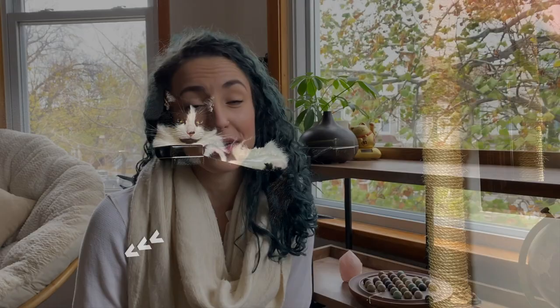When it comes to paint there are multiple different sheens. The rule of thumb I like is: how much stuff is going to be getting on the walls in this room and will I need to be washing it off? The spectrum goes from flat all the way up to high gloss. Flat paint is what we use on ceilings — it's nearly impossible to wash; just touching it can make a mark. Whereas high gloss is almost like plastic on your walls and is super quick and easy to clean with soap and a sponge. Think about traffic and little sticky fingers before you paint.